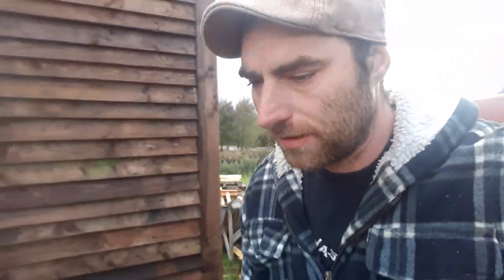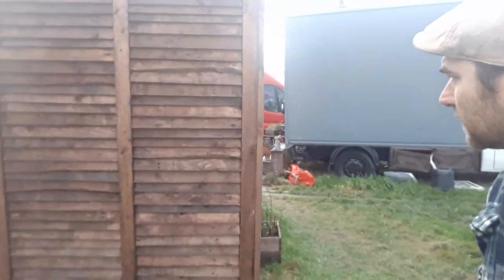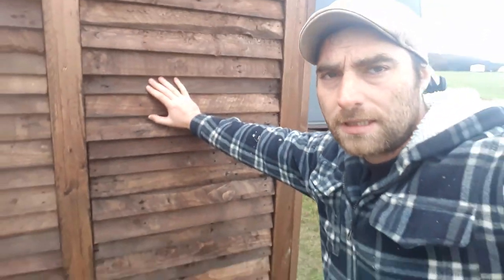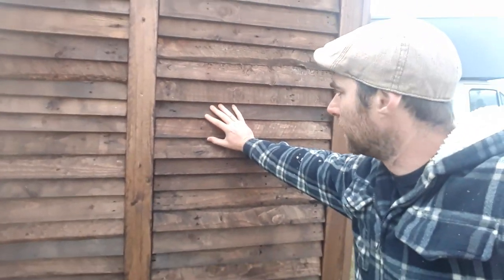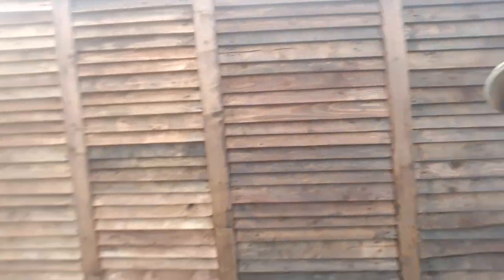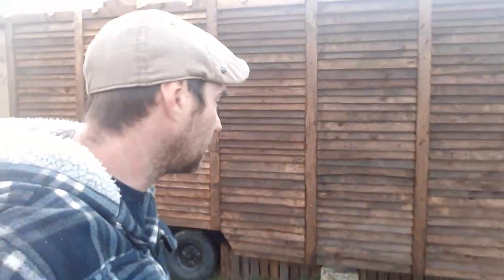The cladding - you can kind of see where it's going, but it's nowhere near finished. If you're a new viewer, this is all just pallet wood. Lightweight pallets you can pick up from anywhere. I've just smashed them apart with a hatchet, cut them to length, and shiplapped them on. So they cost me nothing, which is good, because if I got cladding for all of this it'd be a couple of grand.